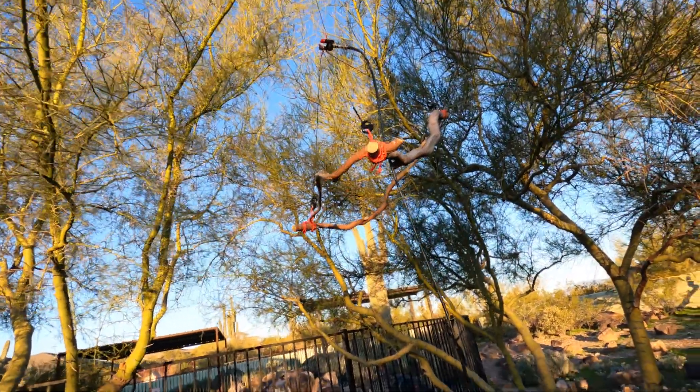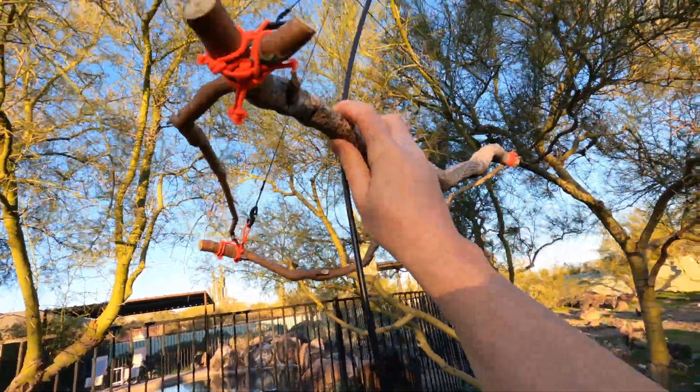Let's jump into a quick after action report. I wasn't planning on making this but I failed to mention a few things. The second I pulled out the multi-tool and had to think on my feet and improvise a longer wire out there, I thought it was worth including in this series. Last week we built the jungle antenna for two meters. My friend on Instagram, Mike Kilo Charlie 8 Oscar Whiskey Lima, said just bring more wire and make larger elements. This was the size of the two meter elements we did last week, and this roughly was the size for six meters.